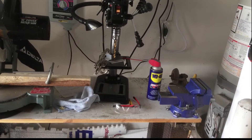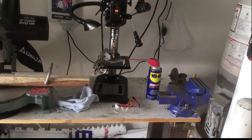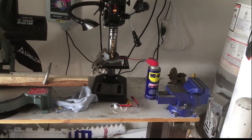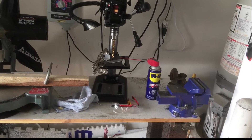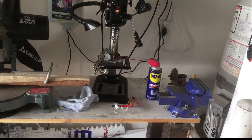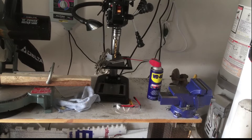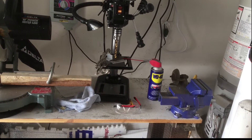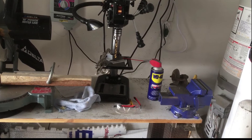Using a lot of the holes that I drilled were 1/8 inch. For those really small drill bits, if you're doing it by hand, it's really easy to break a drill bit — I've already broken one. But if you put it in the drill press and use some WD-40 to lubricate the drill bit, it goes very slick and you're much less likely to break a bit.